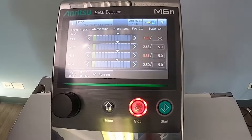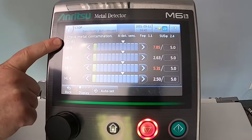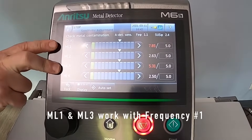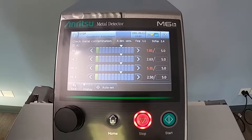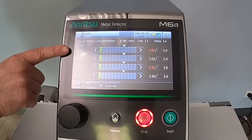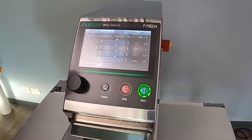The product is already programmed in as cheese. If I click the metal detect level, you'll see four bars — there are two frequencies running, frequency one and frequency two. These tools are paired: ML1 and ML3 work with the first frequency, and ML2 and ML4 work with the second frequency. The M6 has enhanced detection levels — we optimized algorithms and inspection points to create an enhanced version of our standard tools. ML1 is the basic set on frequency one, ML3 is the enhanced suite, ML2 is basic on frequency two, and ML4 is the enhanced one.